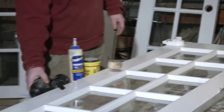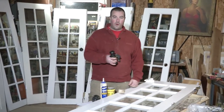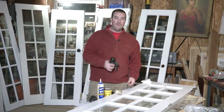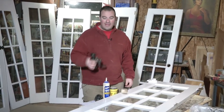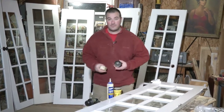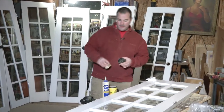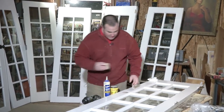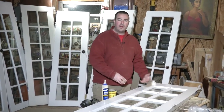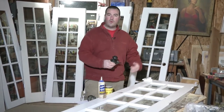As far as the doorknobs go, you obviously don't want a doorknob jamming into your wall, so you're going to have to take half of it off. Once you do that, an easy way to get it back on there is to literally just take a two-inch hole saw into another piece of wood — you're going to get a nice little circular piece to pop out. Literally just stick that right back in there, glue it up, let it sit for a little while, and then you can come right back through and screw your doorknob in.